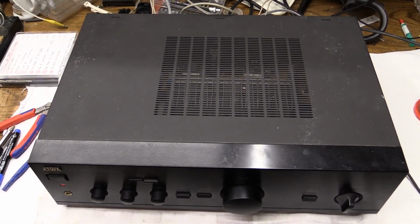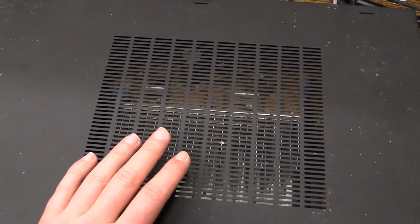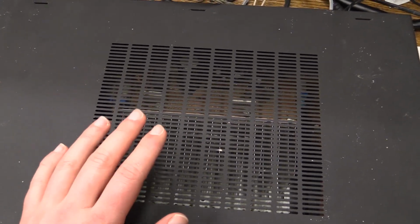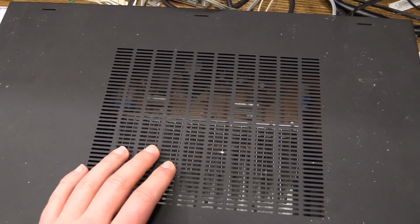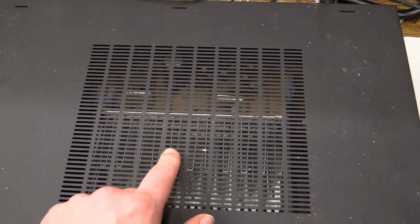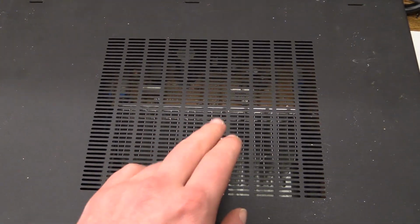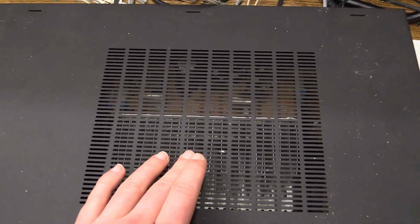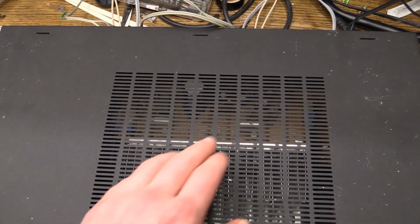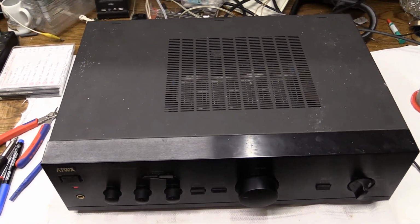But anyway, the thermal design is also a bit of a problem with this. Of course, one of the aims of running this with the loudness on, the bass turned up, and the volume turned up was to really put a bit of a load on this, and I tell ya, that heatsink down there, this flimsy little thing, is burning. You don't want to touch that thing anymore. Don't know what's up with these driver ICs, but I guess those are going to be fine. Of course, the amplification of these transistors is a little bit higher than with the original ones, so for the same kind of output volume, the driver ICs will actually have less of a load on them, which is pretty good, probably.